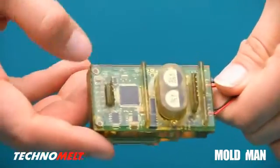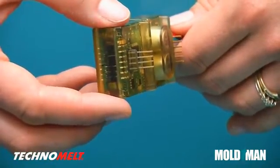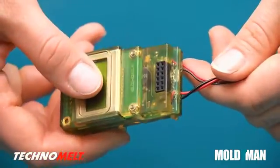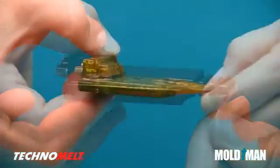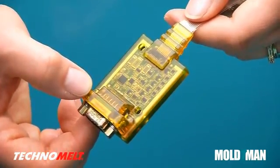MoldMan Skylining is used to overmold circuit boards, components, and antennae, utilizing a minimal amount of material while keeping components in place and protected against moisture, dust, and vibration. Technomelt handles temperature fluctuation well. The low modulus allows flexibility over a wide range of temperatures, significantly reducing stress to circuit boards and components.